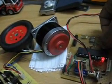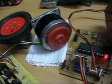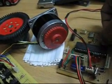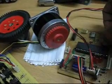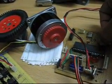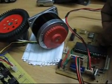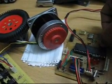And this is the fastest. You can see they are running pretty fast now. If I press it again it comes back to the first speed. Basically the driving of the stepper motor is very standard — unipolar stepping, no microstepping, no complex algorithm, just toggling the port pins — and that's how I am running the stepper motor.